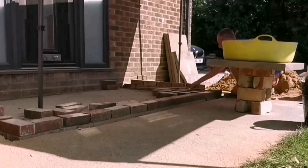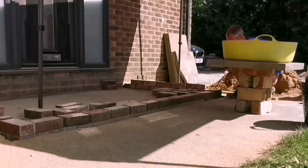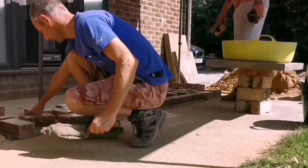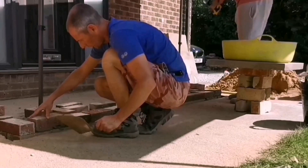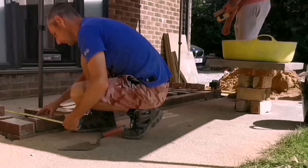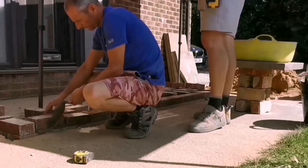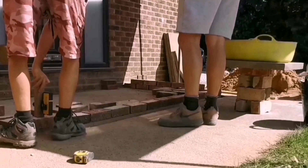So we're doing a little talk-over on this video, something a bit different. So there had been a porch up — an old porch — and that's why you saw the bricks in the corner in the first video. It's actually got foundations down in those corners, so we're using the originals. We didn't have to pour more concrete down. Tim's just got the laser; he's going to put it on that end and we can level it through to get a nice level front. The back actually goes higher and it's already set on the concrete, so it's already got the slope in from the original step wall, which has saved us a bit of time. I'm putting a bigger bed up front because it has got a really big slope — it's quite steep — so we've just gone a little higher up front to knock a bit of that out.